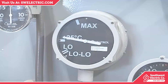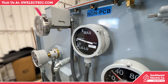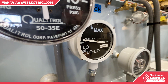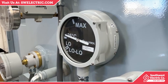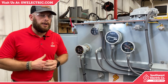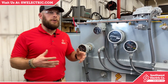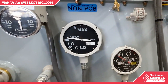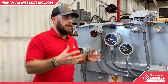Next we have a liquid level gauge. These transformers are filled with oil and all the conductive components inside the transformer tank have to be covered in oil, so it's very important to know where your oil level is. Since these units can be in remote locations or areas not feasible to check every day, if you start to develop a leak and lose oil it could pose a problem — eventually the oil level will drop, exposing conductive components and damaging those components and the insulation surrounding them. So it's very important to ensure your transformer has the appropriate amount of oil to keep everything covered and cooled.